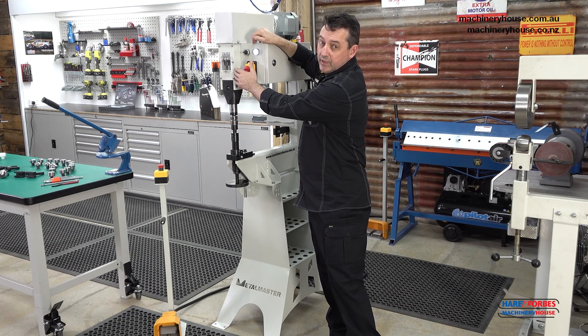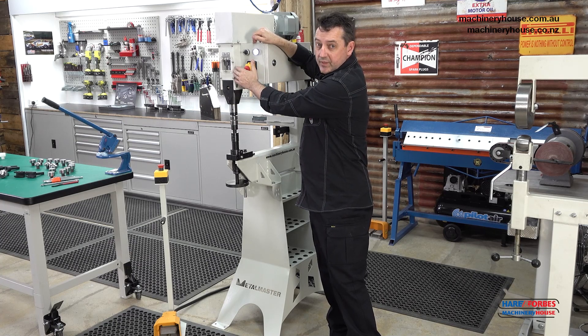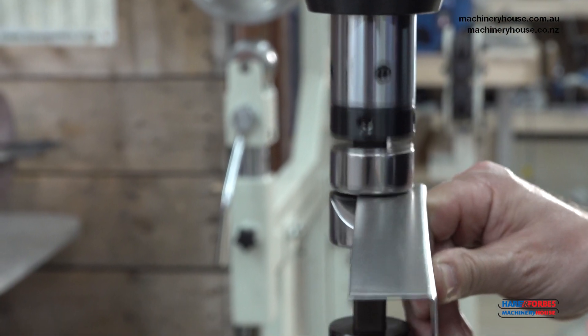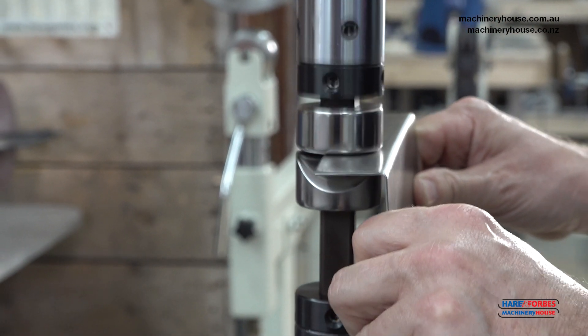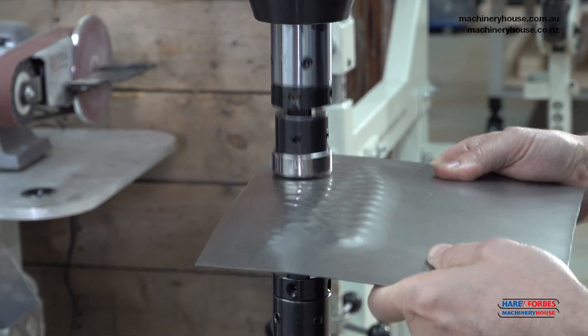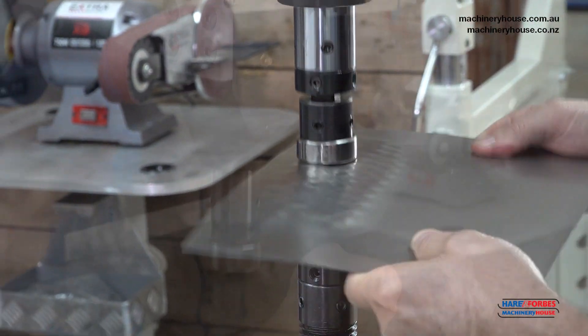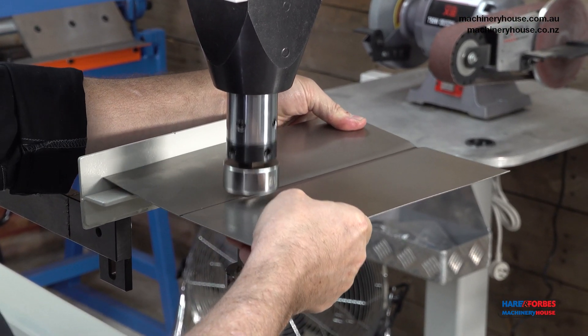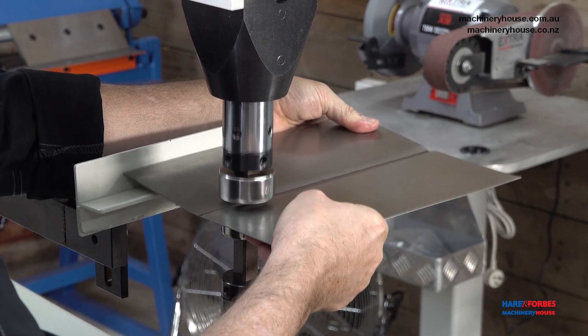With spring or rigid mode: rigid is good for high speed planishing where you have it as solid. And then on your metal forming side, we're using thumbnail shrinking dies, or you can use anything in a low speed application — stepping, joggling, swaging, etc. That's where you would use the spring mode.